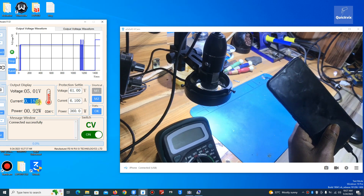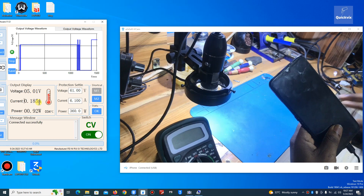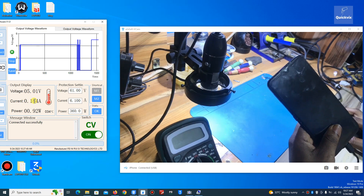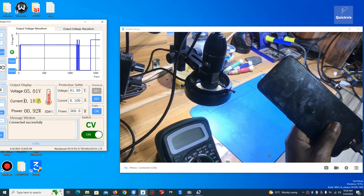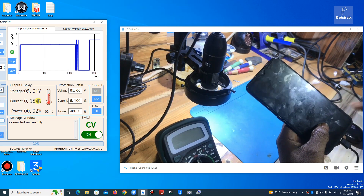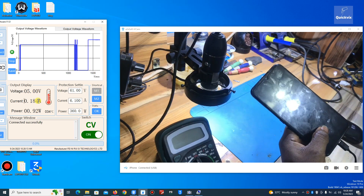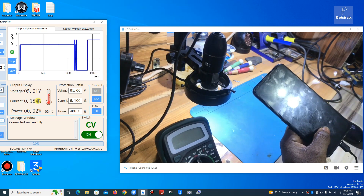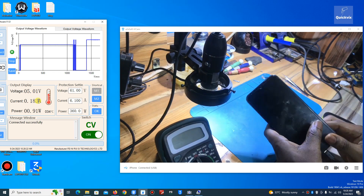In some cases, if you have a phone with a low battery, you will see the phone consuming very low amps, because when the battery is low it charges with low amps until the battery reaches the normal voltage, then the phone would jump to normal current. I assumed the battery was low, but I've kept it charging for hours and still nothing changed, so I'll open the phone and see what's going on.